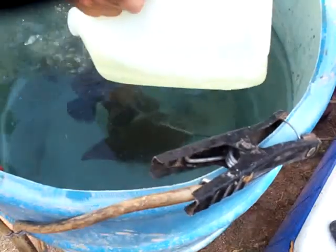The lighting isn't the greatest. Go ahead and pour — as you pour in the muriatic acid — okay, that's good. You'll notice, I don't know if you can see the bubbles coming off, it's starting to get going. It'll start boiling and literally the rust will start peeling right off the metal. Now you can really get a good idea of the bubbles coming off this.